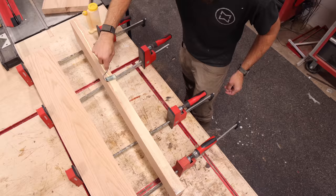Our top-bearing bit is pretty old so I'm switching over to an upcut spiral bit that'll remove most of the waste, staying inside my pocket, and then I'll trim up just the edges with the other bit and it should be good. Cleaned up the corners — let's peel it off and make another one for the next tenon.